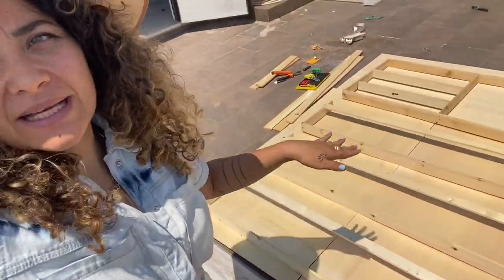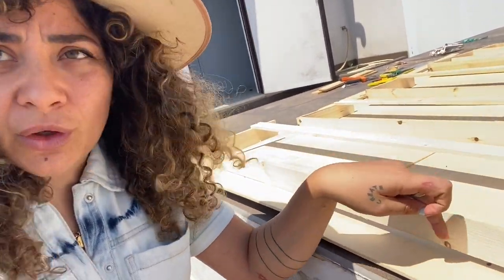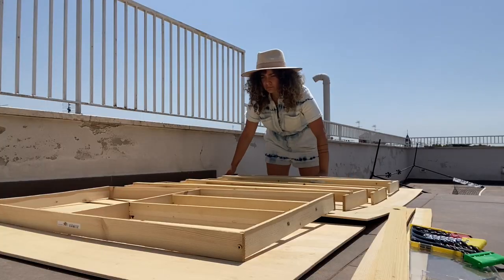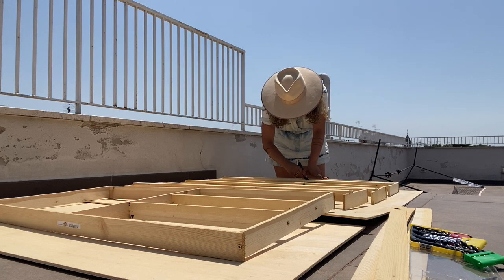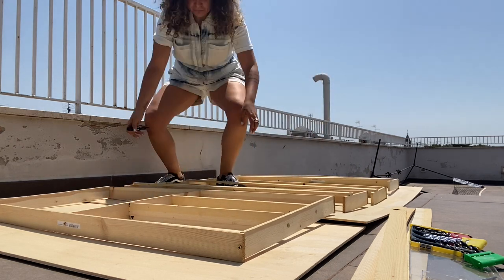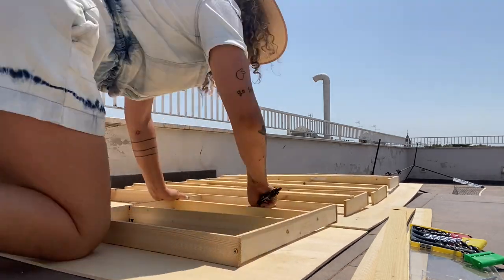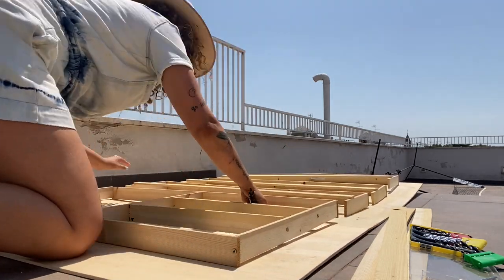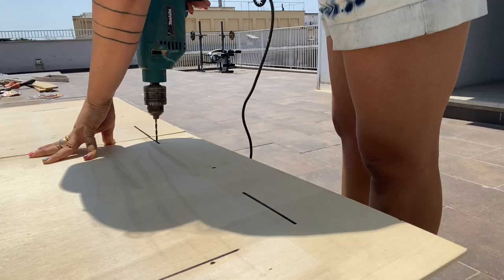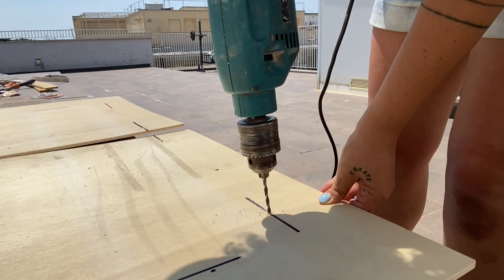We can now mark on the back of the wood — so we won't see all the markings — where the connections are. This way I'll be able to drill the holes to screw the shelves to the back of the wood. I'm positioning the wood strips and spacing them as desired, then marking with a marker exactly where to drill. On the bottom pieces the hole goes right on the line, but on the sides I draw it slightly more external — about one millimeter — so the screwdriver has room to go in at an angle.